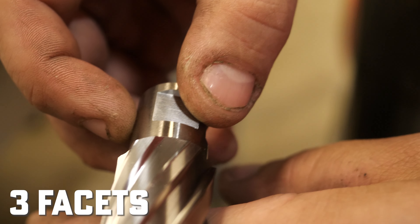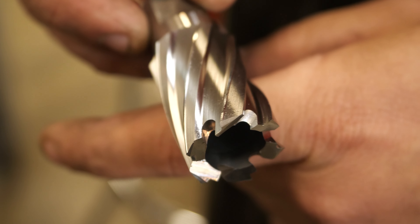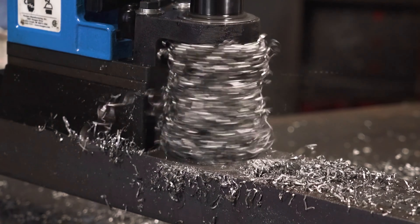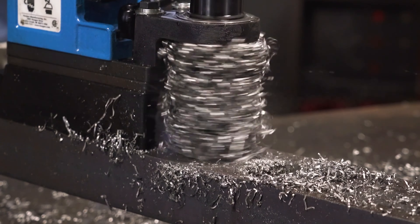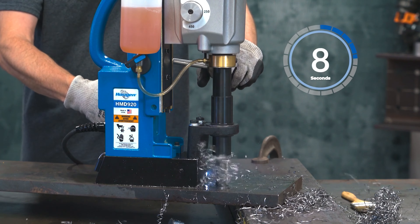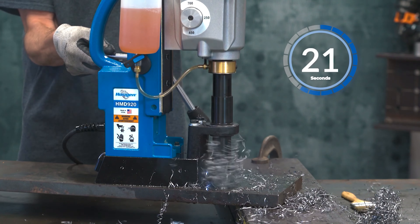One of the other features is the leading tooth has three facets and the trailing tooth has two, and it kind of alternates as it goes around the cutter. That allows for a quick hole. The leading tooth is going to gouge out the material whereas that trailing tooth is going to clean things up so that you can do a half inch depth hole in about 30-40 seconds.